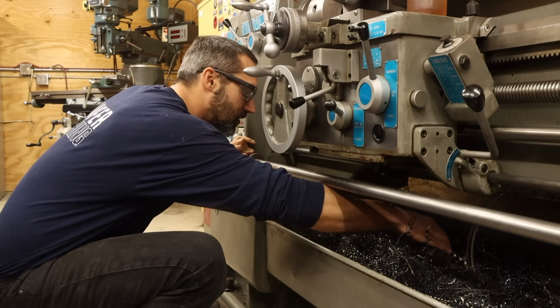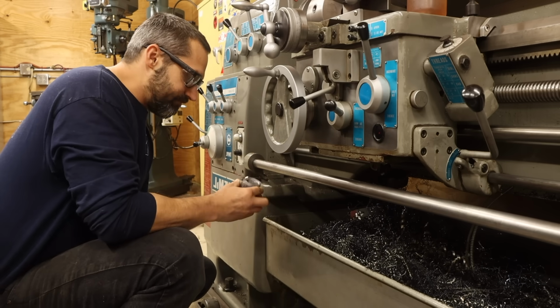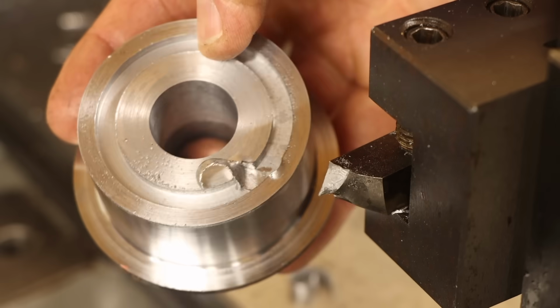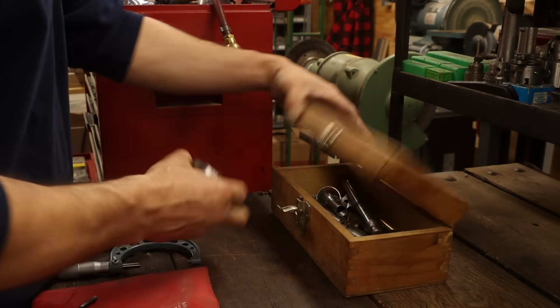Is right, Mr. Brandon. Got a little cocky there, didn't you? And on several accounts, I might add. Not enough grip in the chuck, aggressively power feeding the tool, and no lube? This was bound to happen. And now not only is the part scrapped, but so is the tool. Now take your shame over to the boss.